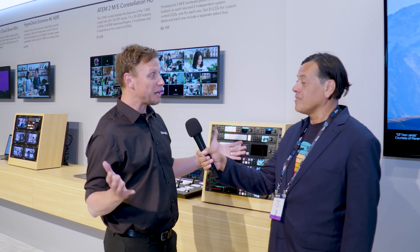People familiar with our constellations will know we have an 8K version, but what we're starting to look at is how we can transition some of those ATEM mini users through to SDI-based products. Starting with effectively a 10-input HD constellation with six auxiliary outputs — that's our first model — and then a second model which doubles everything: 20 inputs and 12 outputs. And then finally a 4ME version with 40 inputs and 24 outputs.